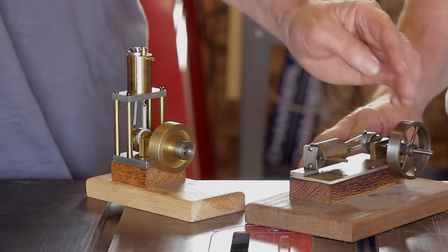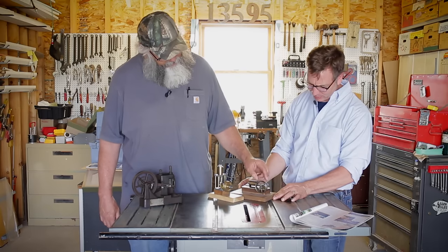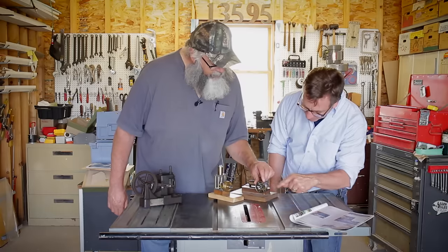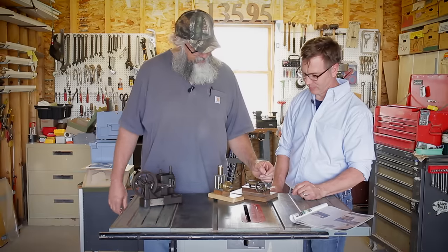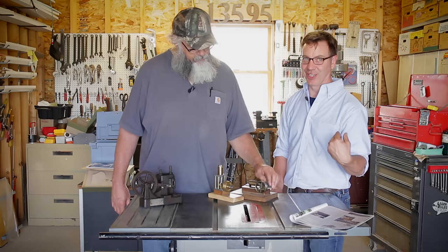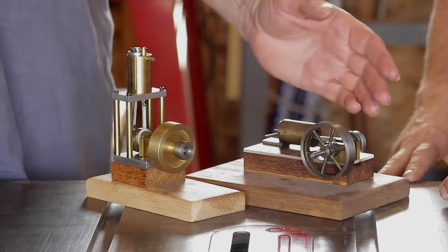This flywheel was built up from a piece of water pipe. Oh, really? I turned the center separate, and if you look, you can see. Oh, so you drilled it through? Drilled all the way through. They were all sticking out, and I got it centered as good as I could and soldered it together. That's a fantastic solution. You guys also know how much I love to do solder. That engine's run quite a bit, and I trued it up after I soldered it.